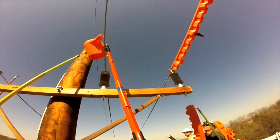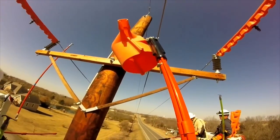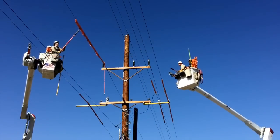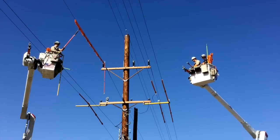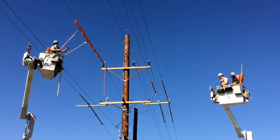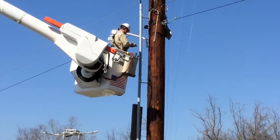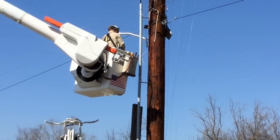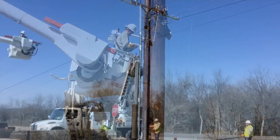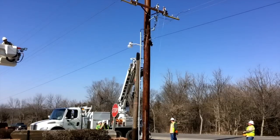There's a tie stick — the yellow tool — that's going to push the pole pad up so he can bring it down. Now they're removing all the conductor hoods, and next they'll take away the line blankets. From the ground view, you can see we're almost done. All three lines or phases are connected to their new insulator homes. This bucket on the right is coming down to remove the last line blankets. Down closer to the ground, there are a couple of miscellaneous tasks — they need to replace a light that was taken off the pole. That ominous-looking machine in the background is actually a pole puller.